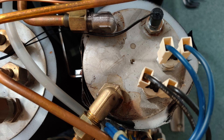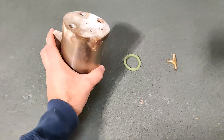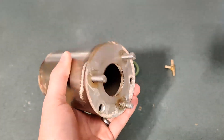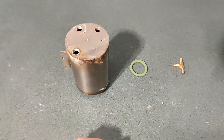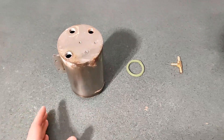The insulation is just gone — disintegrated. You can also see some evidence of possible leaking out of some of the other connections and plumbing that might happen over time, but the majority of the problem was coming out of the sides of the welds. Here's a picture of the inside highlighting the contaminant from the welding process, which apparently rusted through and caused a leak out the side of the boiler.